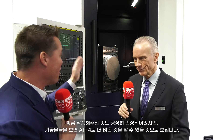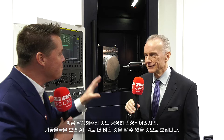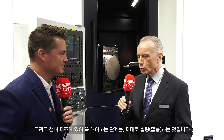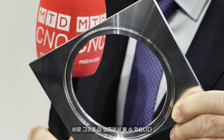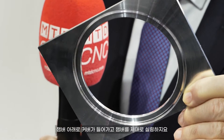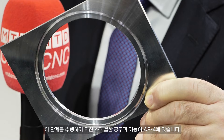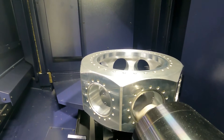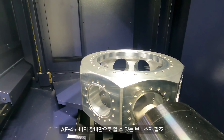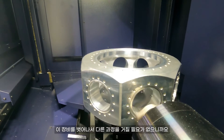You have something else in your hand as well, because although we're incredibly impressed with this, there is more that can be done on this machine. Semi-Con is not only drilling holes. Semi-Con, as we all know, is also chamber manufacturing — a very, very big business. One of the operations you must do in a chamber is make sure it is sealed properly. This test sample is practically a cover that goes under the chamber to ensure it's sealed. With a special tool and a special function, this machine can do the seal operation — and that is another big bonus. Do it in one machine, without going to another operation outside.